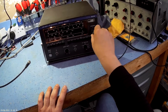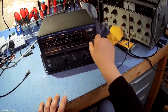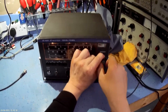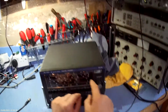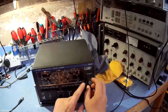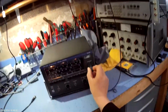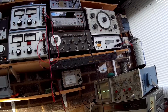On this range now, that should be 400 kilohertz, slightly overreading, 500. And there is a scale calibration, but obviously it only calibrates it for one scale. What you do is you hold this outer ring and you bring this into adjustment. So there's 500. What that's doing is there's a slip clutch in here that allows it to move independently to the tuning resistor. It's a varicap system. That's 6 megs, 7. It's not bad, it's good enough. With the crystal calibrator it makes all the difference.